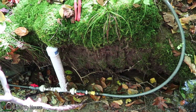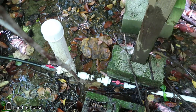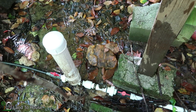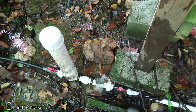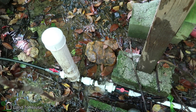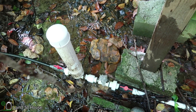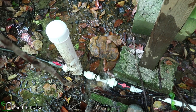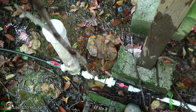I've shut off the delivery pipe to the half-inch pump, and I'm going to start the 1-inch pump and measure the flow rate at the top to see what we get. Then I'm going to do the same with the half-inch pump, and then I'm going to see about combining them together to see if they'll work and also if the output is increased.